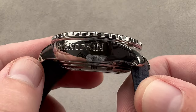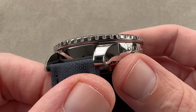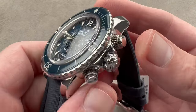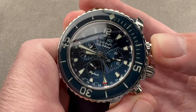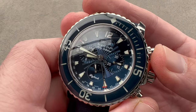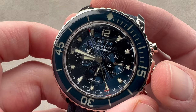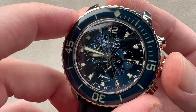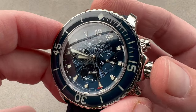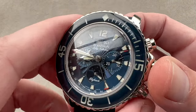The case is fully polished and you can see the brand name on the side. There's also a sharp break between lug and case — this isn't merely a dive watch duplicate of the well-known Seamasters and Submariners of the world; this is a distinctive Blancpain case shape. We have what appear to be screw-down chronograph pushers, but in fact they are merely shouldered, meaning you can use them at any time. Despite the watch's full 300 meter water resistance, I wouldn't use the pushers underwater. The shear guard or shoulder does protect against shearing damage, and because the watch is exquisitely sealed, there's no need for screw-down pushers to maintain that 300 meter hermeticity.